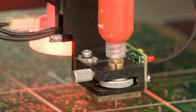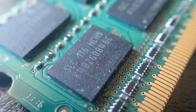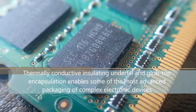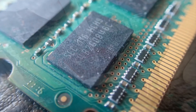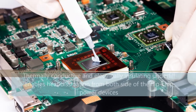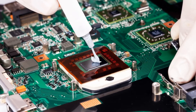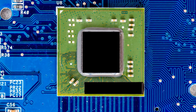AIT underfill also provides outstanding dielectric insulating properties and moisture protection, replacing traditional component lid sealing or molding protection with outstanding proven performance in extreme electronic applications. AIT thermally conductive underfills with an unparalleled high TG of up to 240 degrees C, intrinsic thermal conductivity, and low thermal interface resistance enable heat dissipation at both sides of the package. With a designed low CTE of less than 20 parts per million per degree C, the packaged chip can withstand long-term cycling even for high power chips.